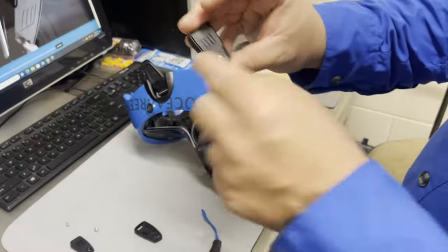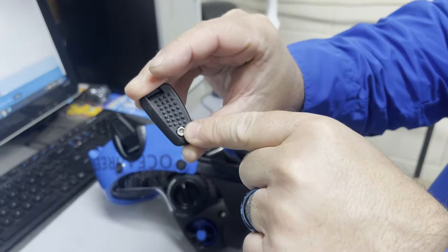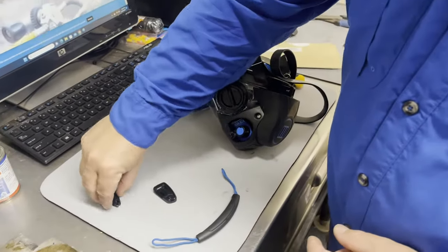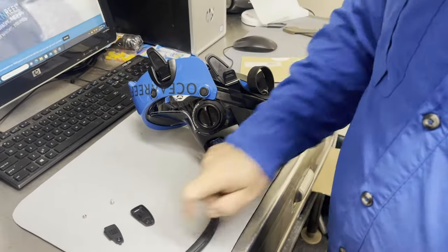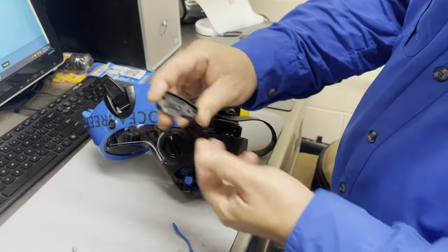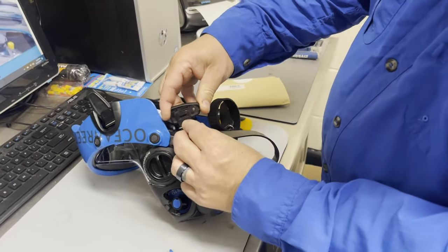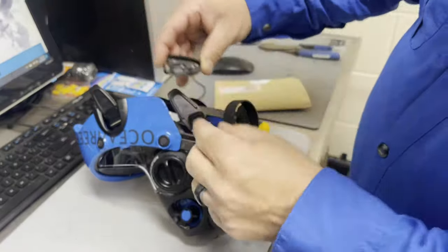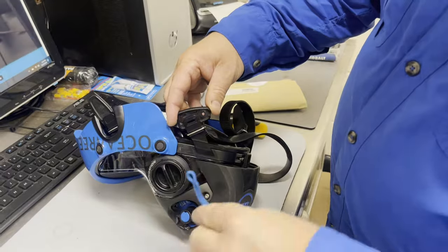If you look at this one here, you're going to remove this screw, which removes the back side of the nut, and you can separate these tabs out. I've already got the left-hand side separated, so I've got a nut, a screw, the upper portion, and the lower portion of the tab. I'm going to start with the lower portion and just get it lined up — you'll see it just kind of fits smoothly in there. There's a little cutout where you can slide it into place, just like that.